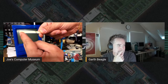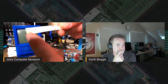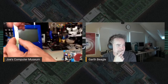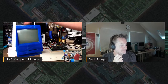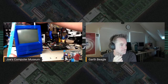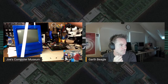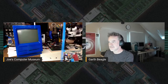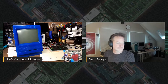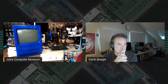where the solder bit is, that's the only part that you actually have to leave. On there, you can cut all this white stuff off with an X-Acto knife and leave just that COB array on there, because those conductor strips are all along the back. So you can make that as thin as that LED strip and get it in farther places if you really wanted to. You could. But that's not how I opted to do it.